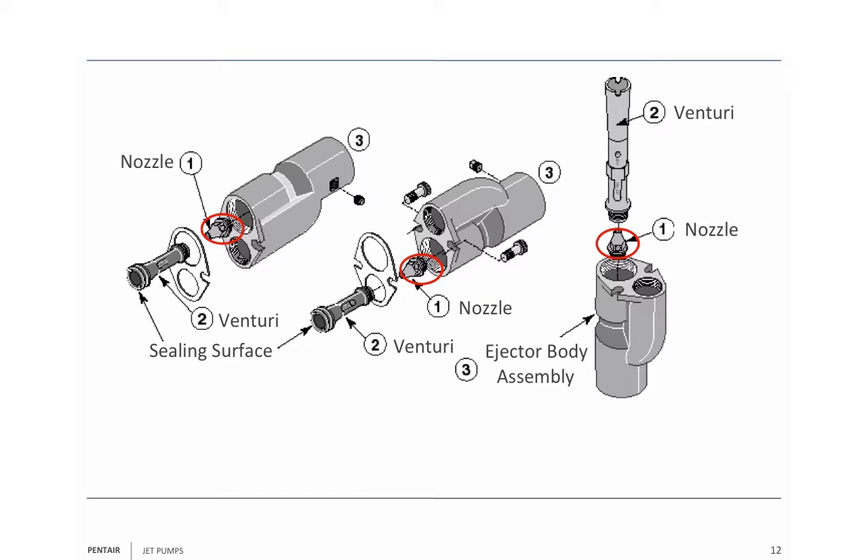It's kind of like taking your garden hose and putting your thumb over the end of the hole — the water coming out of that hole comes out much faster. So we use the nozzle to increase the velocity of the water coming out of it. The next part is called the venturi tube. The effect of a venturi tube is very simple: you take that very fast moving water — it's moving so fast coming out of that nozzle that it creates a low pressure system.